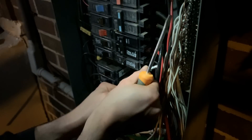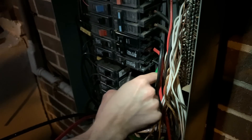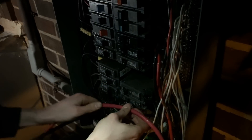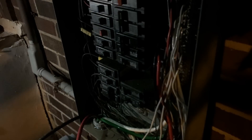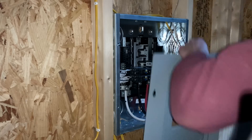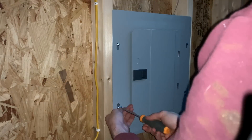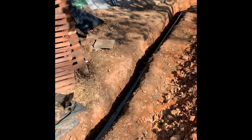Now I'm back at the main house panel where I've cut power and I'm preparing to install the 90 amp breaker. Here I'm installing the ground wire to the bus bar — it's a pretty tight fit working around all of these existing circuits in this old panel. The neutral wire has already been terminated in the same bus bar that we're currently adding our ground to. This is a two pole breaker for our 90 amp circuit. I'm installing our two hot wires into the back of it before I snap it into place. One other thing to note: I don't have a main disconnect present at the subpanel in the shop. This is because I'm only going to have six branch circuits in the box, which is the maximum allowed before I would then be required to add a disconnect.